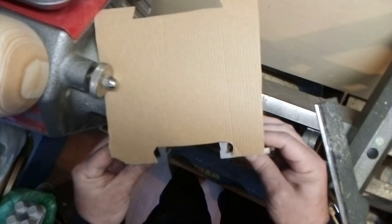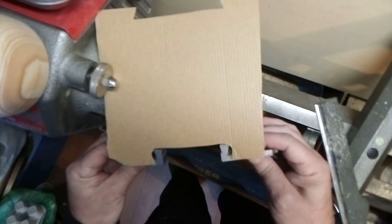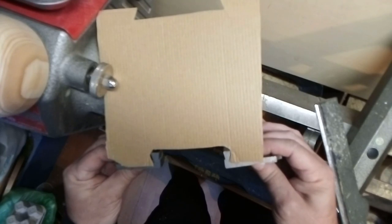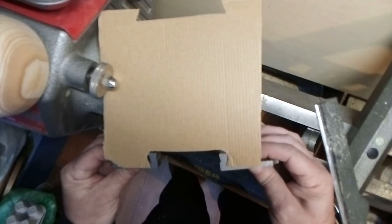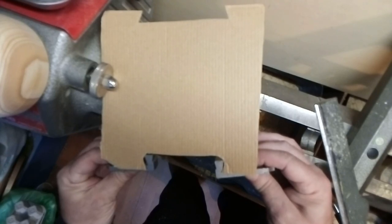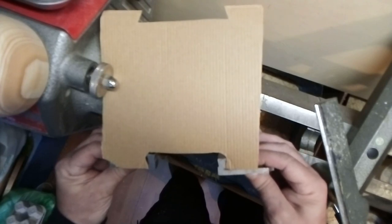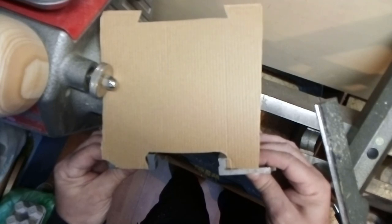So what happens is that we are touching the base here, but as we expand, it doesn't stop here. Since we can keep expanding, it naturally slides down to find the maximum point — the maximum diameter. But it may slide more on one side than the other. As we keep opening, depending on how we are holding the piece, it does this. This is the maximum opening diameter. We tighten hard, it won't open more, and we say it's secured. But as you can see, it is not right. When it starts spinning, it is looser on one side than the other.